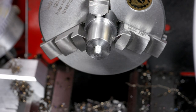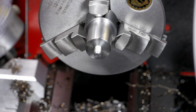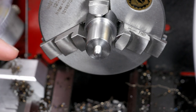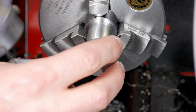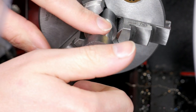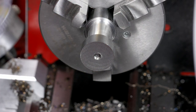I've gone ahead and set up the lathe for the second operation. I mounted a piece of scrap bar stock and turned it down to three quarters of an inch in diameter, so when I'm done here at the lathe I can part it off and take it to the mill to use in a five-C collet block. I also drilled, tapped, and threaded it for M6, then Loctite'd an M6 bolt in place and locked the head off. So what that lets me do is take the face of the blank machined in the previous operation, run it up against the face of the bar stock — the jig — and now I can go ahead and face it to thickness and do all the turning on it.